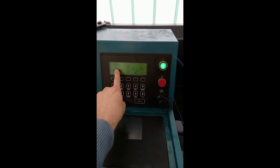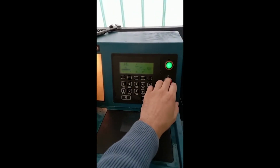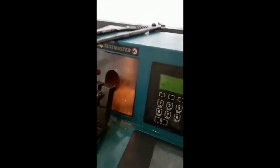150 bar opening that. Not bad at all. Bang where it needs to be. And as you can see, it kicks out a lot of stuff, so it's atomizing the fuel there as well, just to make it easier for diesels to burn. Right, I'm going to crack on with these. That annoying noise you can hear, I'll show you.